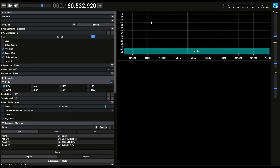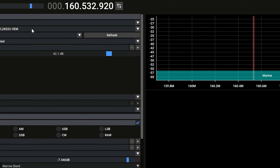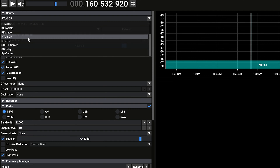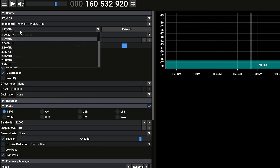Let's look at a couple of settings that you're going to need to begin to listen to train signals on your software-defined radio in SDR++. You want to make sure that you plug in your SDR, and when that happens you'll hear a sound if you have sound enabled. Click on refresh and your SDR should be detected. If you're using RTL-SDR, make sure that dropdown has RTL-SDR selected. If you're using a different SDR, select the appropriate one and click refresh. You'll want to set your sampling rate to approximately 1.92 megahertz.